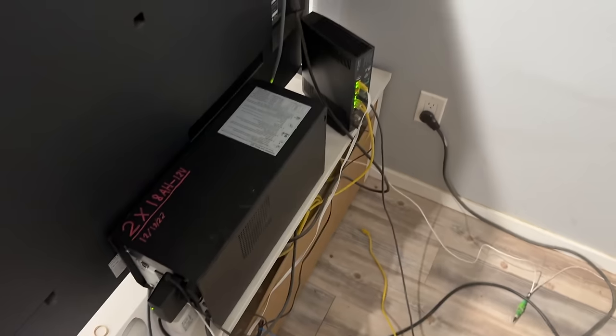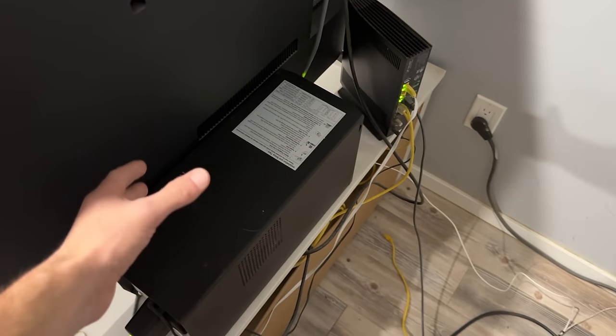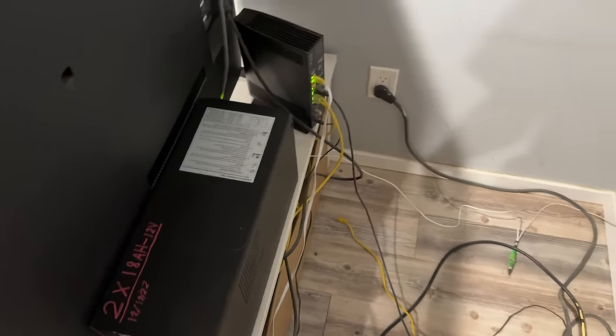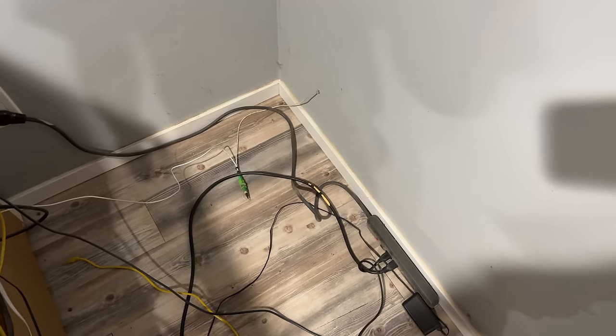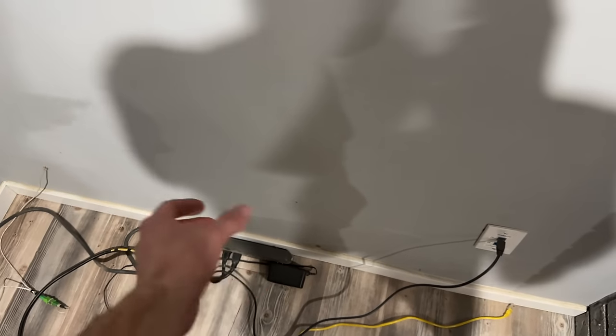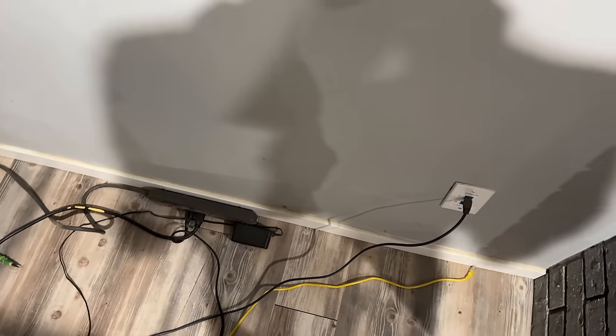So I think for the upstairs Ubiquiti access point, I'm just going to leave it sitting up here. I don't think it's going to make much of a difference. But our downstairs one, as well as the data going to that one spot in my new bedroom, I need to take up here from downstairs. So we need to cut in a low voltage ring and put in a four port plate and take up our wires. I decided to put in a four port just for things to get added down the road.